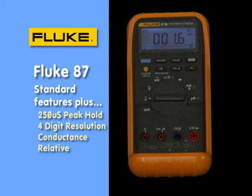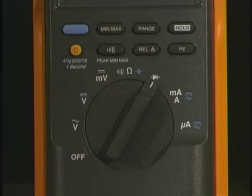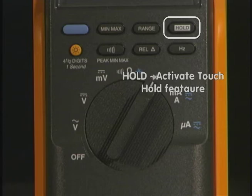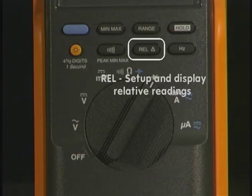The Fluke 87 Series 3 is coveted by a lot of electronic technicians worldwide. It features 250 microsecond glitch detect, which is great for finding problems that other meters will definitely miss. It has additional buttons along the top: the rotary switch accesses volts AC, DC, millivolts for external adapters, resistance, diode test, and so on. The buttons along the top access the min-max data recording function, can manually range the instrument, activate a touch-hold, turn the continuity beeper on and off, and even perform a relative function to subtract one reading from another automatically.